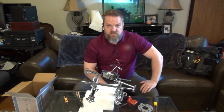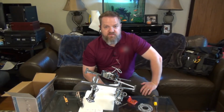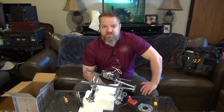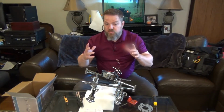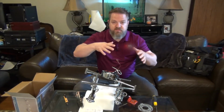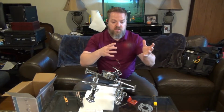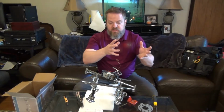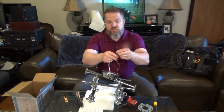Now, this house was actually built in the 70s. If you have a house that was built prior to the 60s, your wiring may be different. So if your house is from the mid 60s or earlier, you may want to look at your wiring and see if you actually have to add a junction box and convert to newer wiring. But this house already has the newer wires.